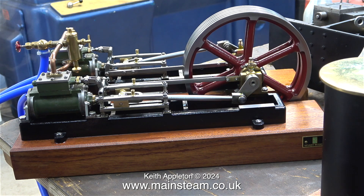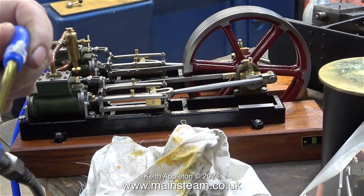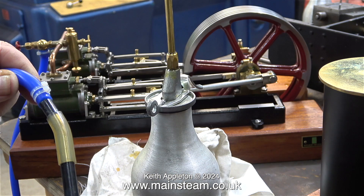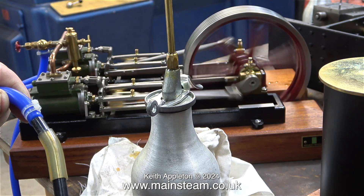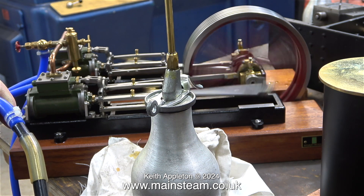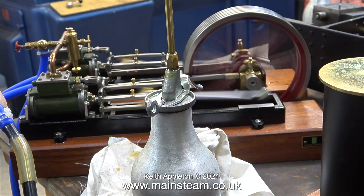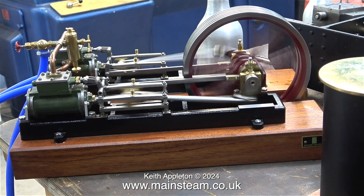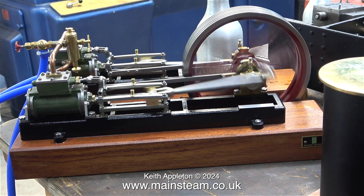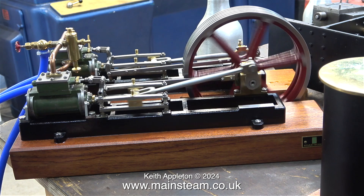And that's it — we're all out of steam, but the video doesn't end there. In with the WD-40 and some steam oil to blow away all the water that's in the cylinders and the steam chests. When running cast iron steam engines it's a really good idea to do this, otherwise the next time you come to run it you may find it will not rotate. This particularly applies to steam engines that do not have drain cocks. You really don't want any water in the cylinders when you put them back on the shelf.